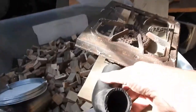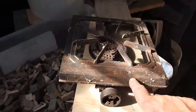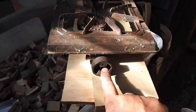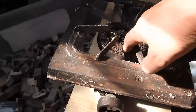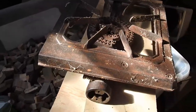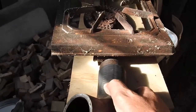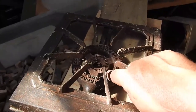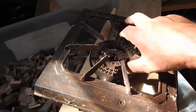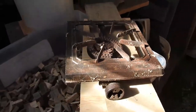What I've found is that charcoal gas — wood gas in general — doesn't work with a standard burner. Normally you have a gas feed right there that mixes with air, and it just will not burn. So the theory I've got in mind is to fit this over that and deliver the wood gas directly to the plenum without mixing it there, such that it mixes as it emerges — much as we're accustomed to with our flare ports anyway.